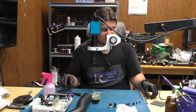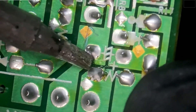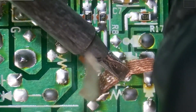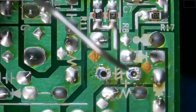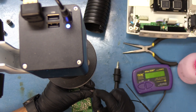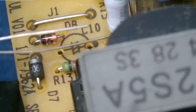We actually have one more capacitor to replace — it's going to be right here. Let's go ahead and clear out the solder points and use the dental tool to clear the holes. This one was supposed to be a 35 volt 47UF — looks like our capacitance tester bent one of its legs. It reads 46.38UF and 1.46 ESR, and it wasn't leaking. The negative goes on this side. Now we can go ahead and solder up all these legs.